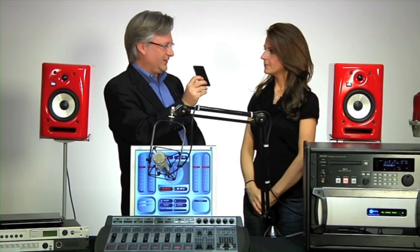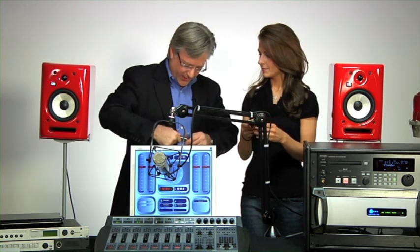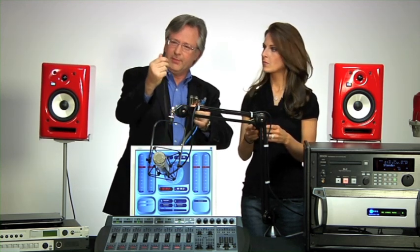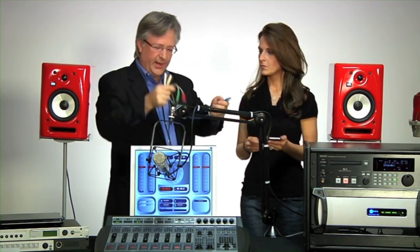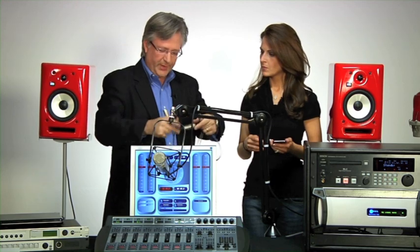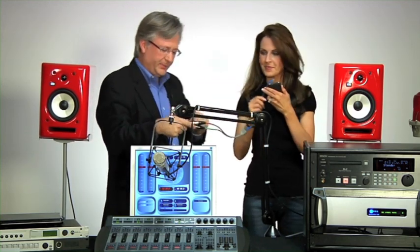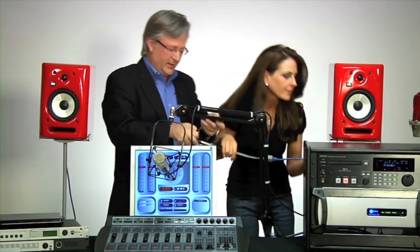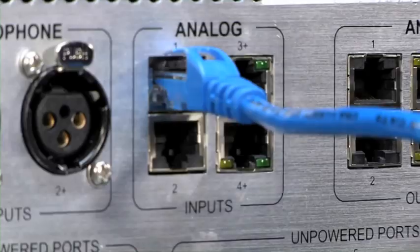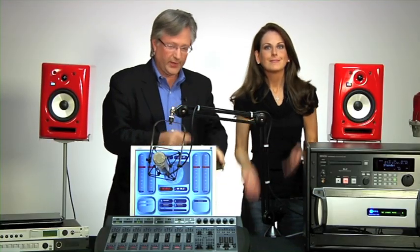Would you like to connect an iPod to the console? A lot of engineers don't really want that to happen, but many disc jockeys do. What I have here is a cable from the music store — it goes from an eighth-inch tip-ring-sleeve to a couple of XLR males. And earlier we had the XLR female to RJ45 patch cord. This doesn't need to be very long, so we've used a short patch cord. We'll plug these XLRs in, and at the other end we plug into the back of the power station into one of the inputs — it doesn't really matter which one, we'll figure that out later. And we'll plug the eighth-inch end into the iPod. That's going to work great.